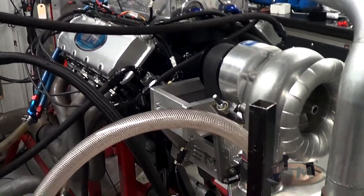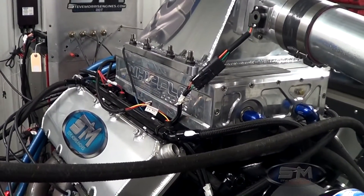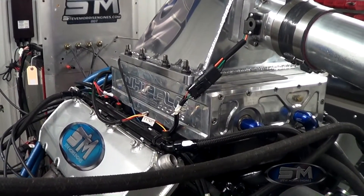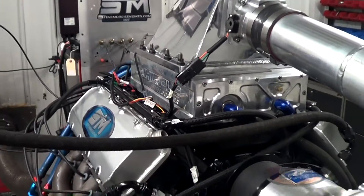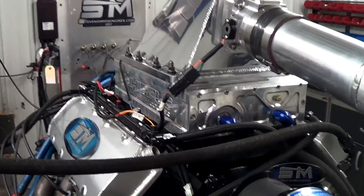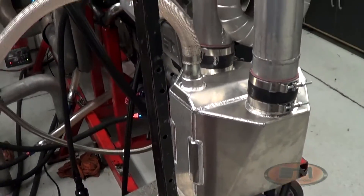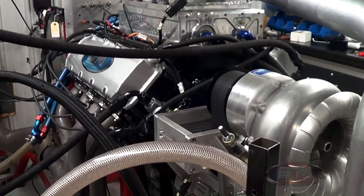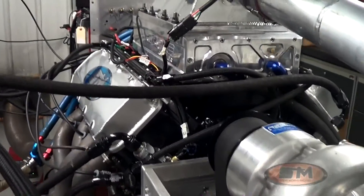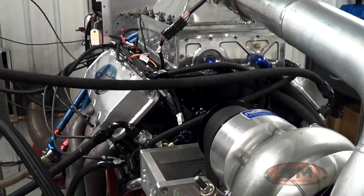We've been maintaining — as you can see here — we're still using the chiller. We circulate all water and we're trying to maintain about 60 to 70 degree water going to the intercoolers. The water goes through the chiller first, then it circulates out of the chiller into the larger intercooler and then back into the tank. In the boat, the sea pump would go its own section into the chiller, into the intercooler, and then back out of the boat.